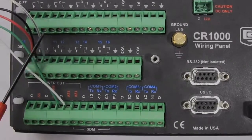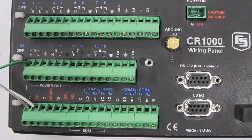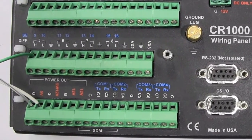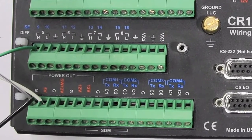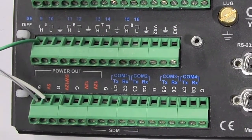The SP212 and SP215 provide an amplified voltage output and therefore require an input voltage in order to operate correctly. Make sure to check the sensor manual for the proper input voltage range for each model. Connect the sensor's white wire to the positive voltage signal and the clear wire to the negative or ground of the power source.